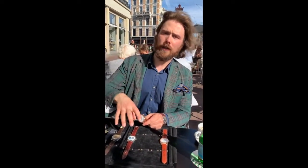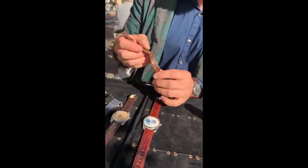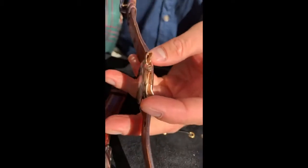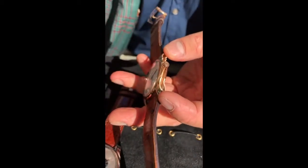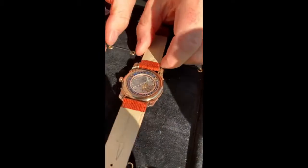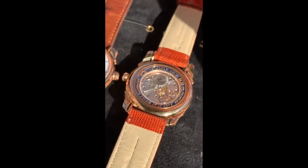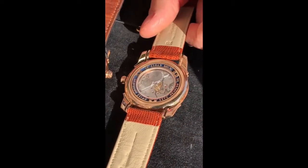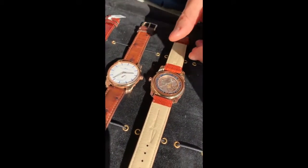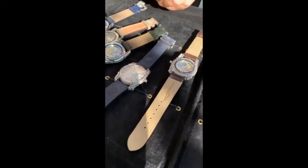A year later I had the first final product. Before that, cases had been experimented with in printing but never successfully commercially, so I think this is a novelty. It has the same open lugs but the lugs are a little thicker because the material is softer. The case is made out of one piece and the movement spacer is also printed in gold — quite a lot of gold. The blue on the inside is a lacquer I put to show which model it is. For this one I do the blue, and for the stainless ones I have the black infill — it differentiates the models.